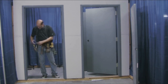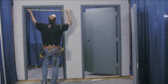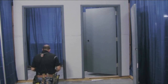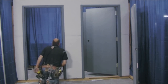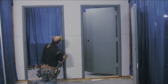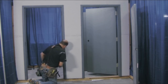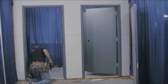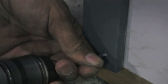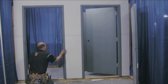Now you're ready to go. You want to set the bottom corners. It's a 36-inch jam — 36 inches on the top, and you want it to be 36 inches on the bottom. Right now we're at 37. You want to take your level; I normally level the hinge side. Level the hinge side, set it where you want it, bring it over, then set a screw in the trim face — just a standard drywall screw, at least an inch and five-eighths minimum, two inches is probably better. Run it in, screw it in tight. Now that leg is set and plumb.